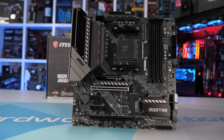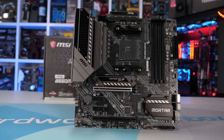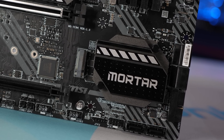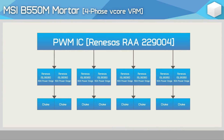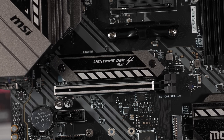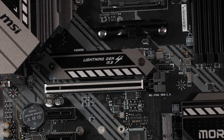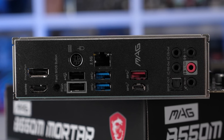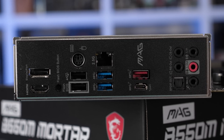For $10 more, MSI offers the B550M Mortar at $160 US — kind of the micro ATX version of the B550 Tomahawk. In terms of V-core VRM design, it's a step up from the previous two MSI models, moving away from discrete MOSFETs by using eight ISL99360 60A power stages. It's worth noting that although there are eight power stages, the board only features a four-phase V-core, as MSI is doubling the components per phase rather than the phases themselves — something ASUS has done for years. The Mortar drops two USB ports from the IO panel compared to the Gaming Plus, which I find disappointing, but otherwise despite the MATX design, the two boards are very similar in features.